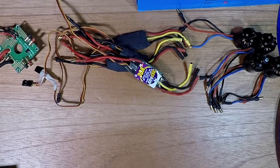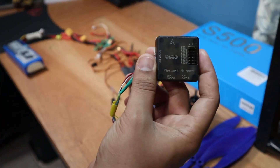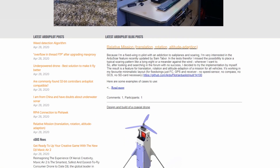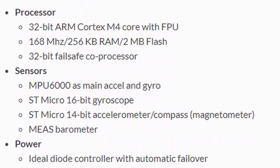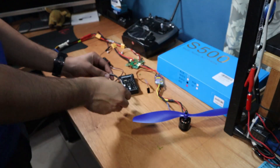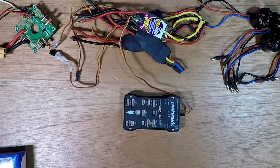Also connected to the ESCs is the flight controller, which is really the brain of the whole quadcopter and takes a lot of the hard work out of flying. This is a Pixhawk 2.4.8. I also have an OpenPilot CC3D and my two homemade flight controllers which run Multiwii. For this build I'm using the Pixhawk since it has a lot of online support from the ArduPilot platform. Inside the Pixhawk there are two accelerometers, two gyroscopes, a barometer, and a magnetometer — basically a digital compass. All of these sensors, plus an external GPS that came with my Pixhawk, allow the drone to know where it is in space. The flight controller then controls the speed of the four motors via the ESCs so the drone can be controlled, hover, and fly safely.